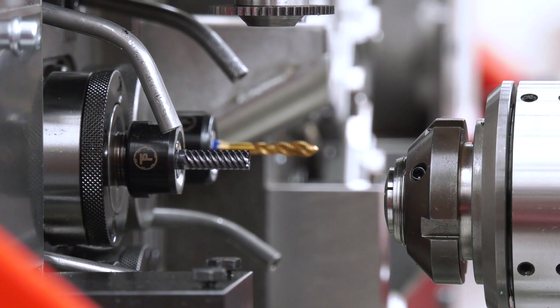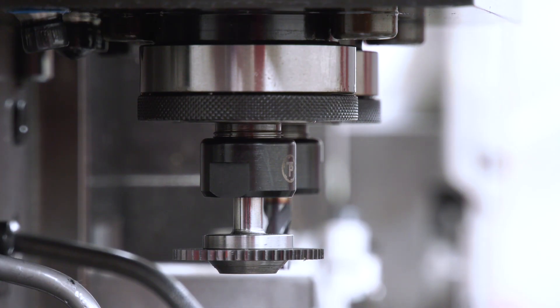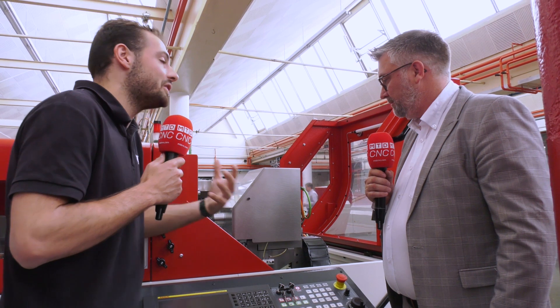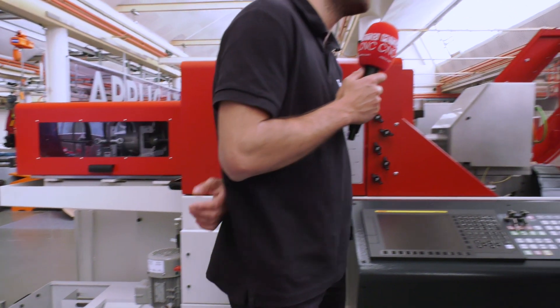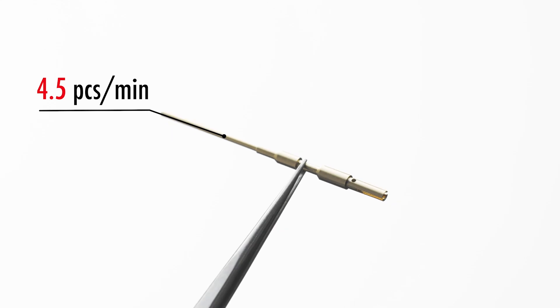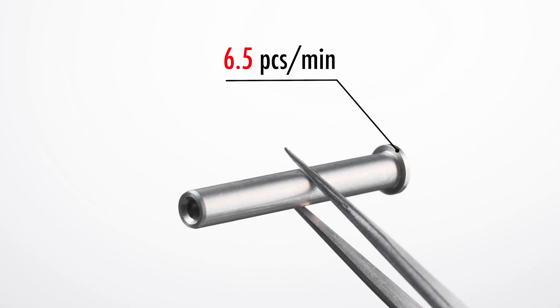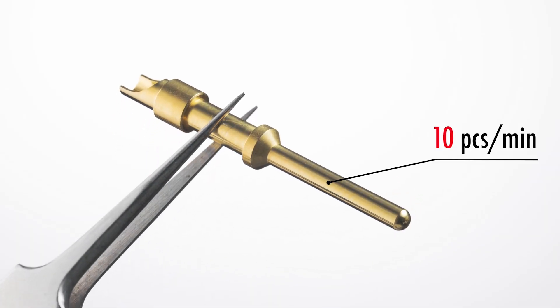That's what I love — the different applications. So you've got a tap here, a really high multi-fluted end mill, a center drill, a spot drill and a slitting saw as well. Features? Gears, splines, slits — you name it, we can do it. If it's anything under 8 millimeters and it's turned in high volumes, the Escomatic machine is designed for that. We can manufacture any type of turned parts from as small as 0.3 millimeters, up to 28 millimeters diameter and 300 millimeters in length.